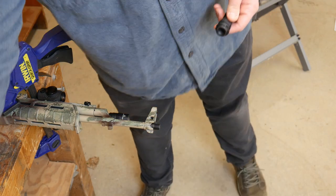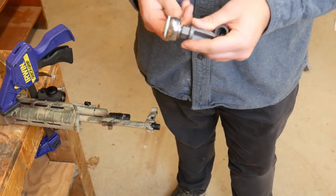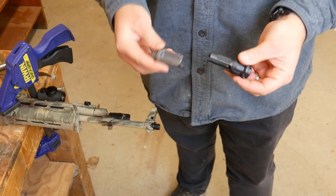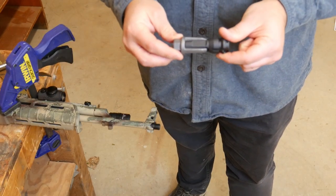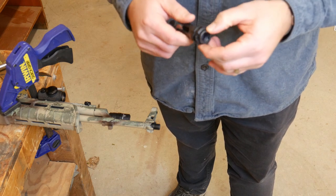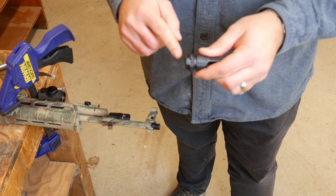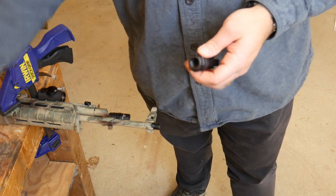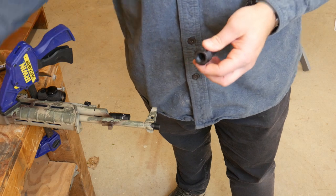I just have some Rockset, and I have this fancy tool here that goes on a ratchet or a torque wrench, which we're supposed to use, but we're just going to do it down and dirty here today — it fits inside the muzzle device. This is a fancy little tool that I picked up. But if you didn't want to buy that, this muzzle device, and most of them, are going to have some kind of wrench flats so that you can just hand torque it on with a normal wrench.